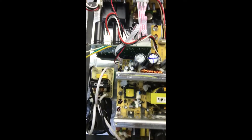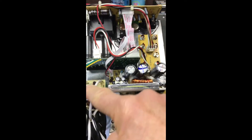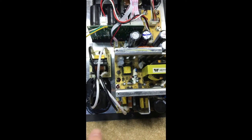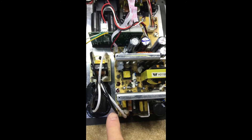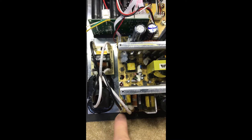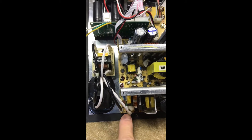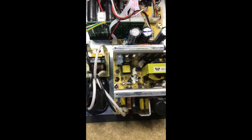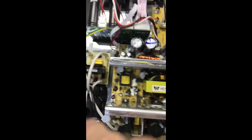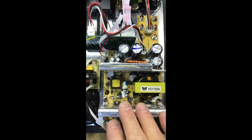We have the amp panel on the bench. To disconnect the power supply there is a connector up here, another one here, and then the main leads coming in at the bottom. These two connectors are keyed so there's only one way you can put them back in. Pay attention to how this is done: the black is the line and the white is neutral. To get the amp board out there are a half dozen or so Phillips screws around the perimeter — take those off and we'll get this board on the bench.